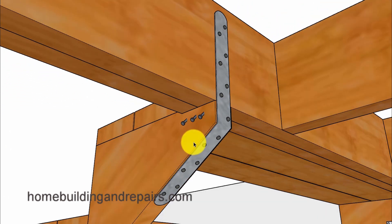Now would be a good time to mention that the person who inspired this video was worried about the nails splitting the wood, because the wood is old and dry. They have a good point. If that's the case, you might want to pre-drill your holes or stagger your nailing — for example, you could put one nail here, then one over here, then this one over here.